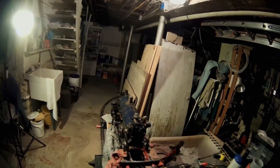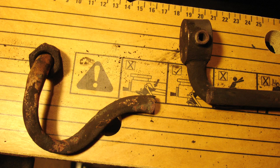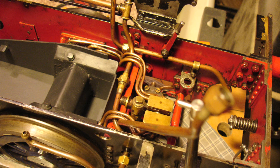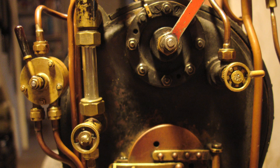Going through here there's another engine — that's my five-inch gauge simplex. This engine had a superheater problem in the smoke box front end and I re-brazed that up. Now it's going back together again after being cleaned, with the regulator valve, oil lines, and water pump inside. Various other things have been overhauled and the bearings and seals have been replaced. All I need to do now is a water test on the boiler and the superheater to make sure everything's tight, as I don't want to reassemble it and then find myself having to pull the boiler off.